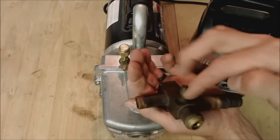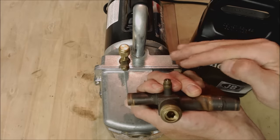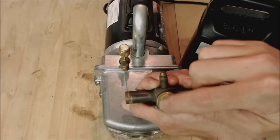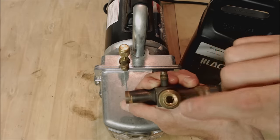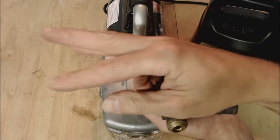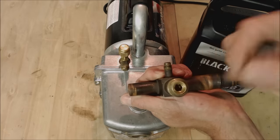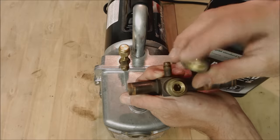Tip fourteen: this is a two-position vapor service valve. If you know your vacuum setup is good and your vacuum pump is good, and you positively pressure-tested with nitrogen and found no leaks, but then you do have some type of leak when vacuuming — it could be from the actual service valve. Right at the top inside, there's a rubber O-ring that can get dry or worn out, and that could be where your leak is from. With the valve all the way up, you're vacuuming over towards the compressor and in the line set going to the evaporator coil. You could use your other service valve to break the vacuum with refrigerant, basically locking this one down.